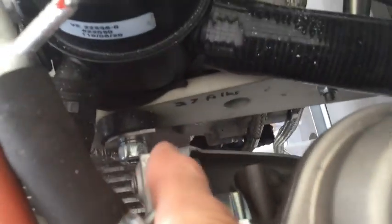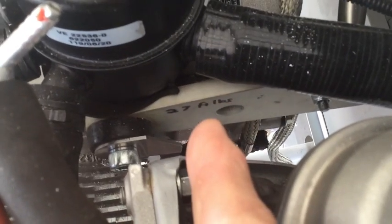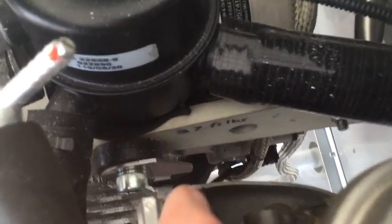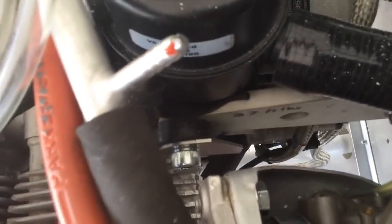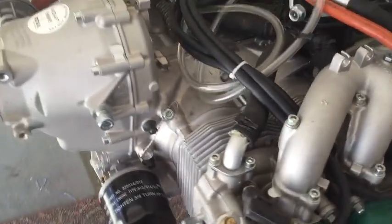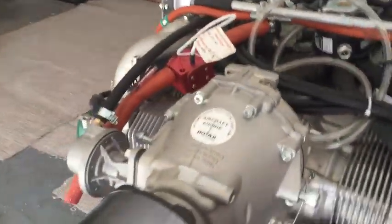The other big change is kind of difficult to see. In order to get the motor mount — the top motor mount is right there — I usually torque it to 27 foot-pounds. The fins have to be cut away so that the bolt can come in and out without interference. Once that's cut away properly it's super easy, but it's a worry. They don't use a dynafocal mount; they use a regular mount.